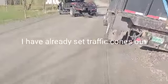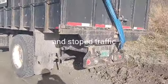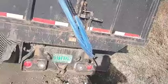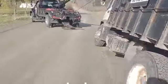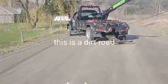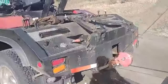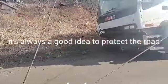He plowed himself in pretty good coming around that corner. There's a culvert in front of it so I got to turn it pretty steep coming right out, and I don't dare go forward any because it gets deeper and wetter. If I don't have anything under that right rear tire she could get into trouble. So I got this strap over the back as a precautionary measure, a down pull from the d-ring, and a two-part line to the front to lift the front out. We'll get started.